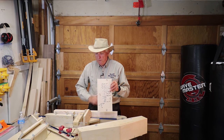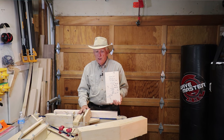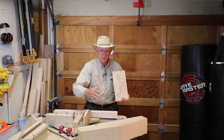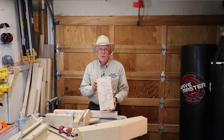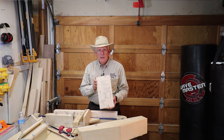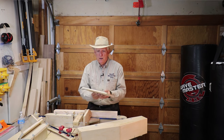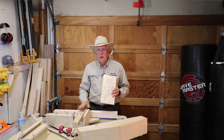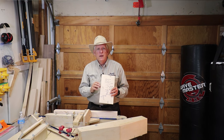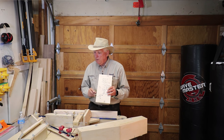This is a piece of wood that I cut five times for my new sled. I'm not going to go through the full method because both William Ng and Marc Spagnuolo give a good description of it, but it's essentially a way of cutting, cutting, cutting, cutting, and then measuring the last strip — comparing the far end versus the end near the base. If they're identical, you've got a 90-degree cut. If the top is wider than the bottom, you don't.